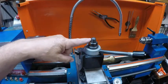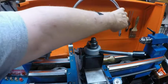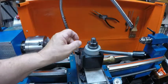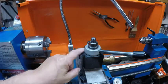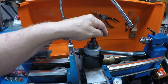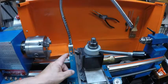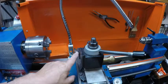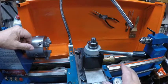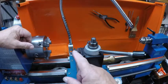You want to have it up here. And what I'd like to do is — I don't like to close this up when the hose comes up. I don't like to close it up any more than that, because it's going to be hard on the pump. So maybe I could have a T down there with one going into the tray to relieve it, and then up here have another one where it would go on the blade. So I'm going to try that. And down there I might have an adjustment, so I can close it down and let it come up here and get a less stream.